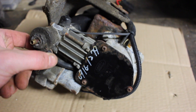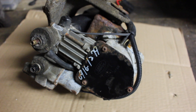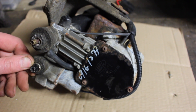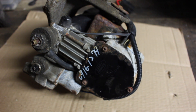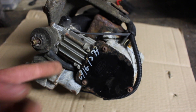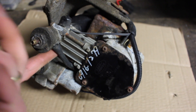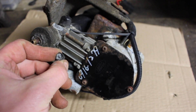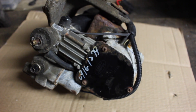The code was something to do with the exhaust outlet. I had full intentions of rebuilding this one, but when I took it apart, firstly the collets on both pipes were completely seized and disintegrated once I tried to remove the air lines. Also I can see that on the exhaust valve the pipe going to it has broken off the valve, and it looks to be caked solid with some sort of aluminium corrosion. For that reason I chose to go with the new compressor, but we're going to tear this one apart just to see what condition it's in.